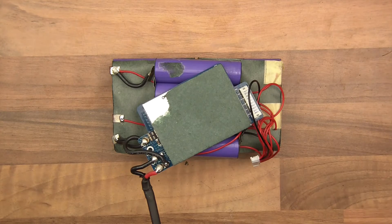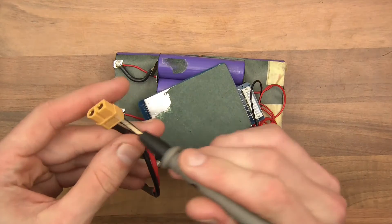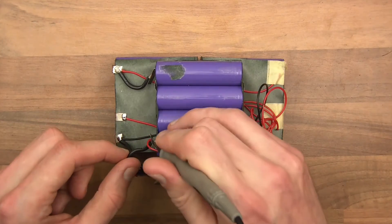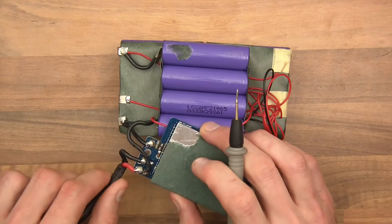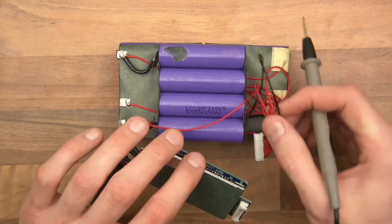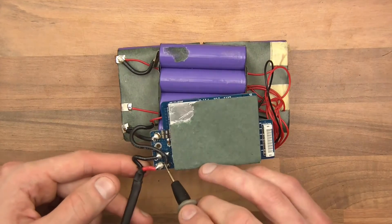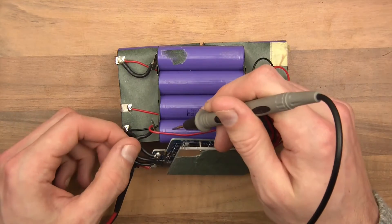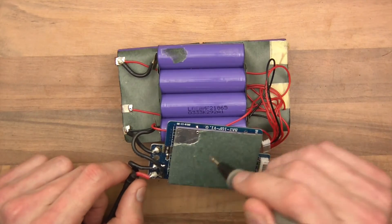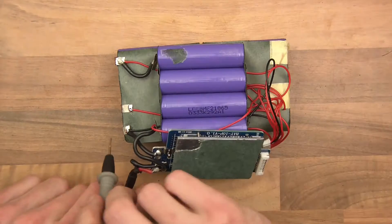Let's have a quick look at the circuit. I don't understand the circuit fully, and I don't think it's necessary. But what we do know is that 42 volts comes in through the red wire and goes straight to the plus. There are only two wires in and two wires out, so at some point this has to charge the pack. These are just sensor wires to check things. You can see that these are shorted together, so plus 42 goes straight through. Since the thing isn't working and I suspect the cells aren't dead, that tells me there's some sort of break on the ground side - it goes through all of these and then comes out here.